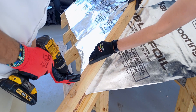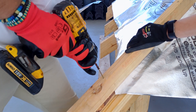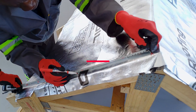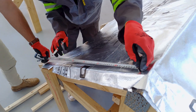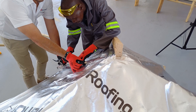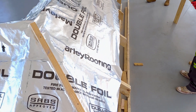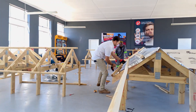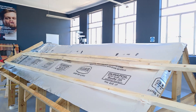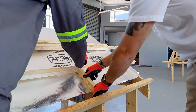In terms of the hip tree itself, we recommend fastening by means of screwing, ensuring a sufficient length to penetrate the batten by at least 40 millimeters. After having established the position of the apex batten and the first tiling batten, proceed with marking the batten centers onto the underlay of the rafters to ensure horizontal alignment. This can be done with the use of chalk lines struck horizontally so that the battens can then be fixed accurately. It is also worth checking horizontal alignment at regular intervals, or using a batten spacer made to the required batten spacing as a helpful tool.